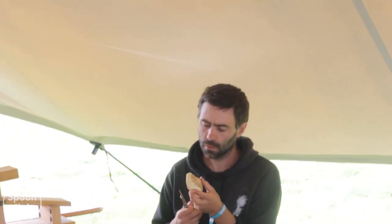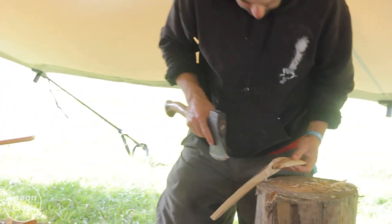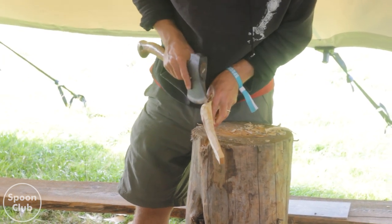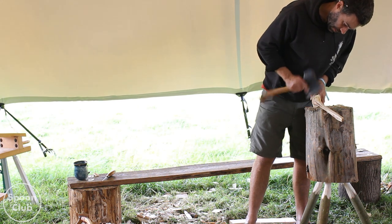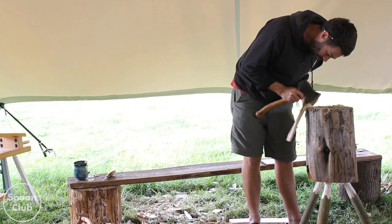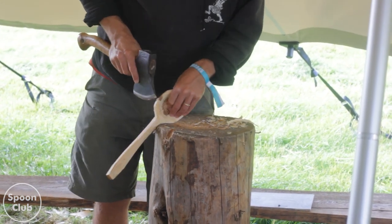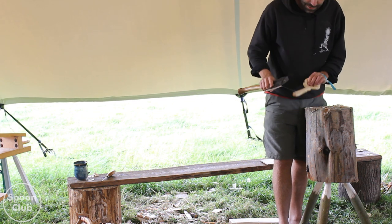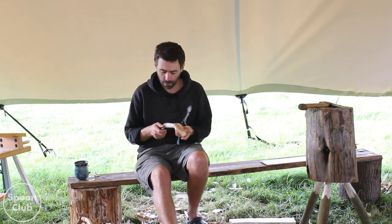This is where this knot is again. Don't be afraid to go back to the axe. The grain's all over the place on this bit so I can almost just chop through it with the axe. Whereas with the knife I can't make the axe do that negative curve as it were. But that's got rid of the worst of that bit.